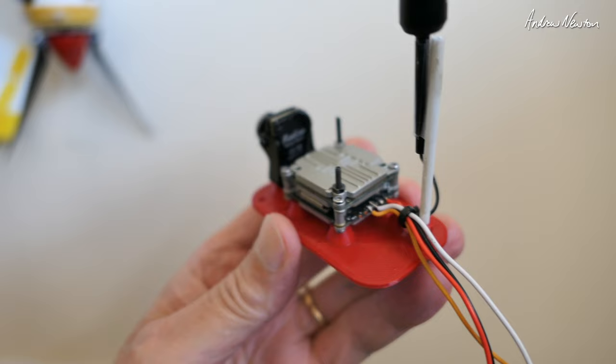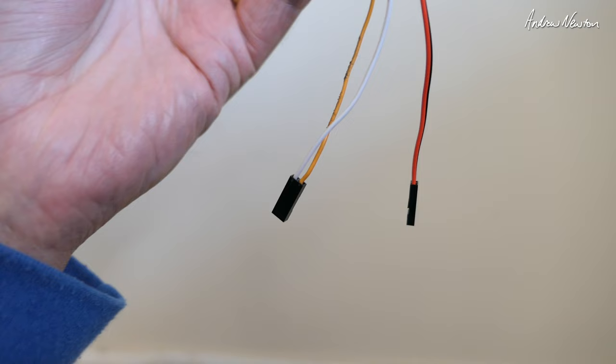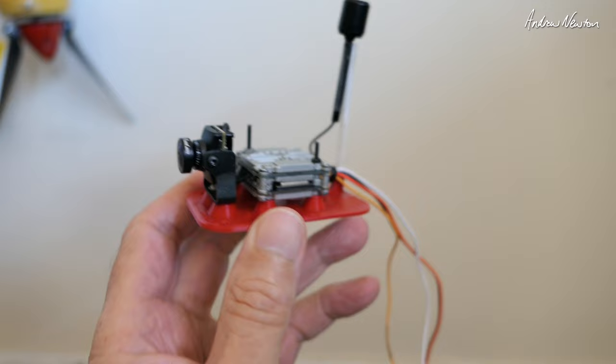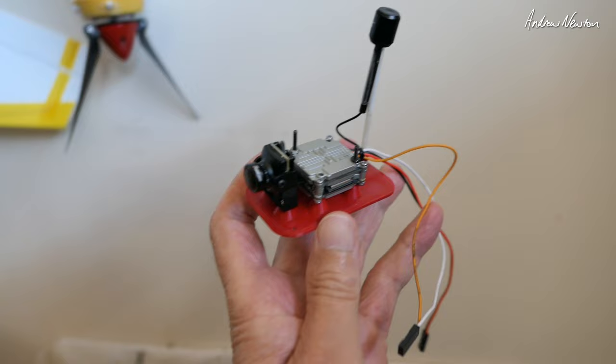Here it is all soldered up and mounted on my standard little 3D printed mount — I'll put a link to that in the description. I've got a cable tie holding the cables because they're fairly delicate. I have two two-pin DuPont connectors for power and the RX and TX. If I'm not using a flight control board I can just connect up the power to at least 8 volts, and in the V1 goggles I would have to turn off temperature control. I've been getting questions about the O3 setup and how you get it out of low power mode — that's how you do it in the V1 goggles. If anyone knows how to do it with the other goggles, feel free to leave comments.